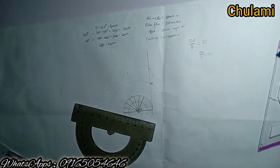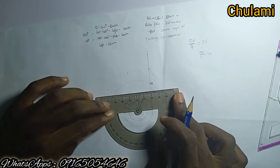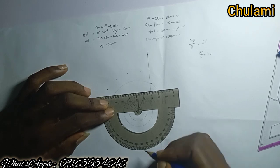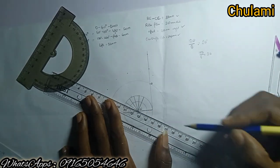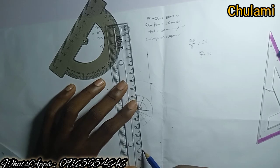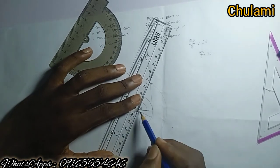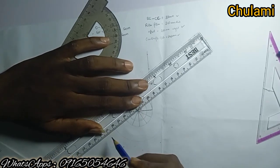For the fall part: where it's falling I'm going to be lifting — there is motion there. The dwell is where nothing is moving, no change whatsoever. Dividing 180 degrees by 6 gives 30 degrees each. So go 30, 60, 90, 120, 150, and the rest. This is easier to divide into equal parts. Take note: the convention is always six equal parts.